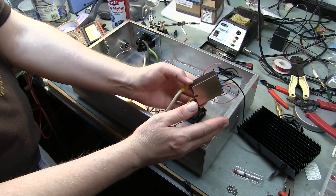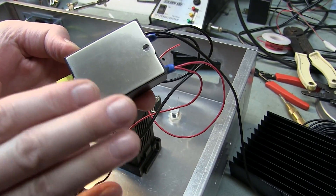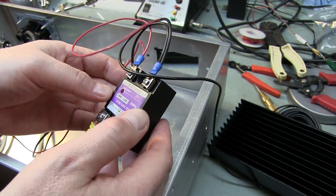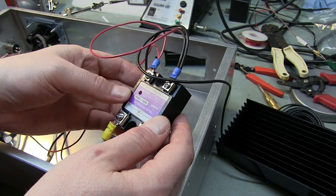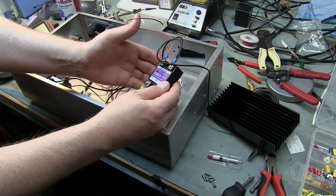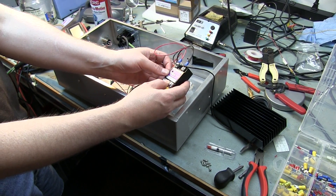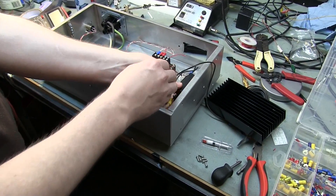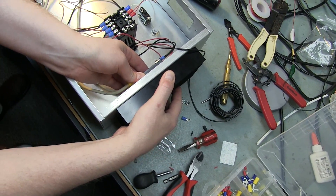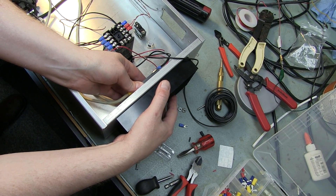One of the key things inside this besides the electrical goals is being safe. This is the backside of the solid state relay — it's metal, it's not electrified. The only thing you really have to be concerned with on these is keeping them cool. If they get hot you're going to melt pieces and your relay will go out; if you can keep it nice and cool, it'll last a long time — millions of switches without any problems. Our chassis is set up so this bolts in here, and then this big heat sink bolts on top of the chassis and sinks the heat from the solid state relay outside so it stays cool no matter how much amperage is running through it.